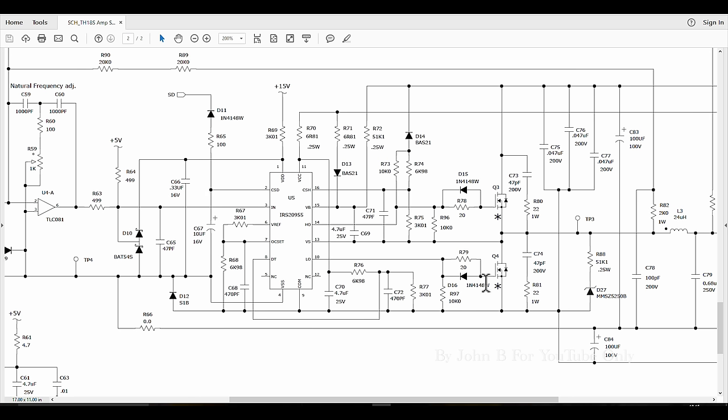So it should be simple, yeah, change the chip, change the FETs, job done. But as you saw, I had a problem on the power supply as well, had to analyze that. Then look at the input board, why was my thermal light coming on, that sort of stuff. So hopefully this video's helped you diagnose any faults on a Mackie SRM or HD1801 subwoofer. Thank you very much.